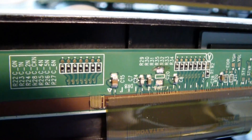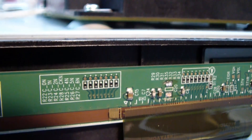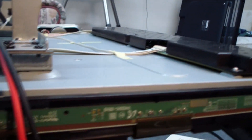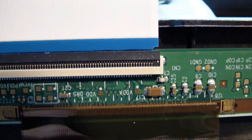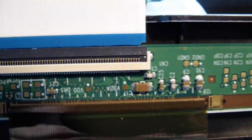You can see where the capacitor was after I took it off. I used solder wick — heat on the top and bottom to get the excess solder, then heated the whole thing until it was hot enough to come off. I took all three capacitors off — no change. But then I looked and found this capacitor: the big one laying horizontal. That one has a dead short across it — a lot lower ohms than the others. The other ones are about 4.8, and this one is about half that. That one's a dead short.